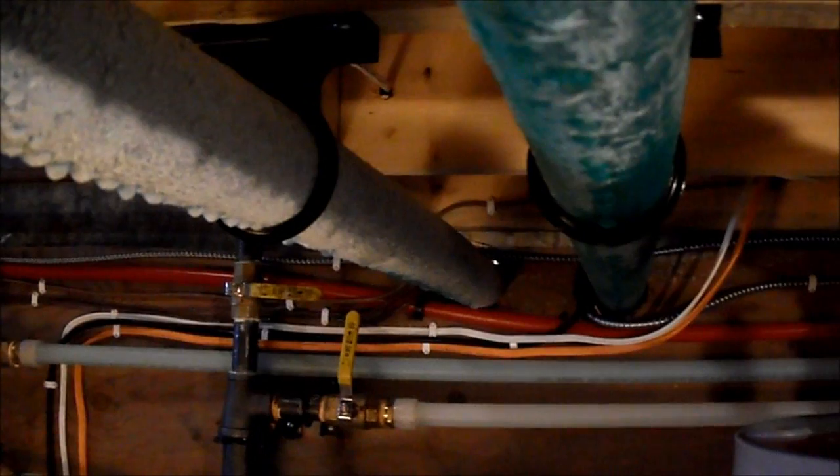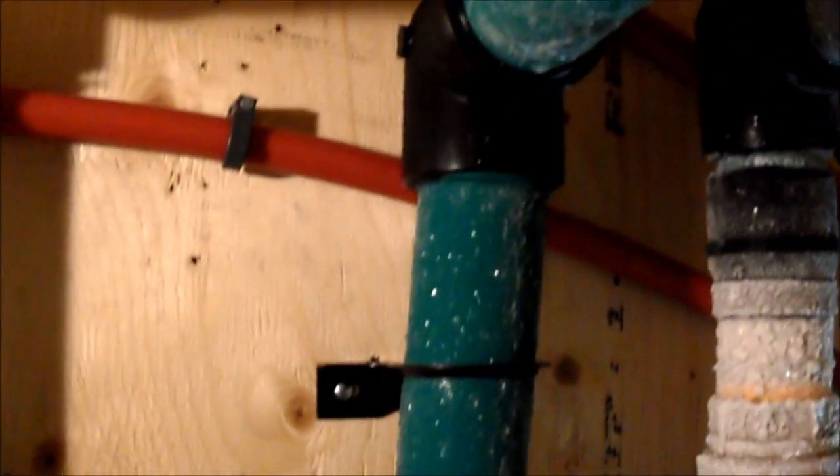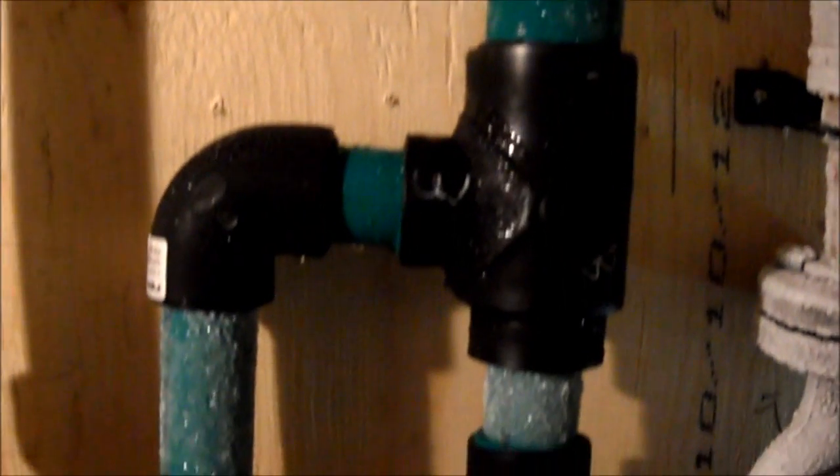Coming across to the take-offs here. This piping is all going to be insulated eventually. We're going out to the brine tank. Coming back in this other line that doesn't have quite as much frost on it, back into parallel again, and across to the two heat pumps.